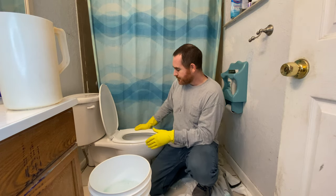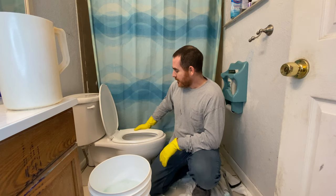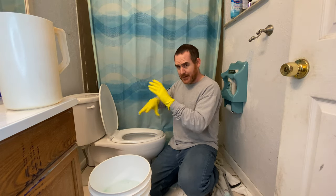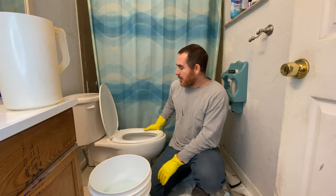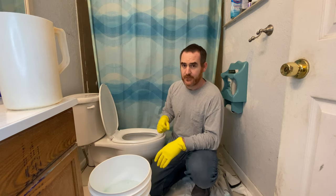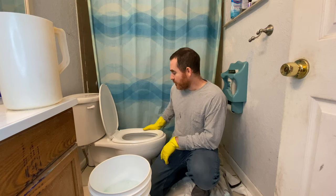This might save you a lot of money if you were going to hire a plumber. The soap kind of sits in there and greases things — it can kind of smooth the pipes, let stuff flow through. After it's been sitting a while, you can also come in and use a plunger. I've done a video showing how to clog and unclog a toilet with a plunger. That's one option. But let's see if we can do it with just soap and hot water.